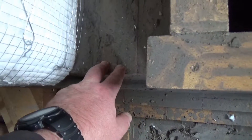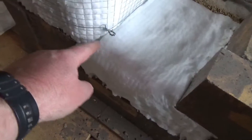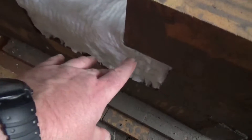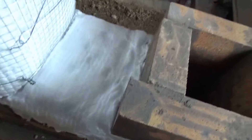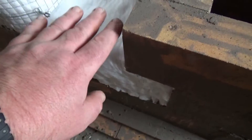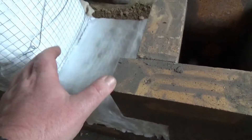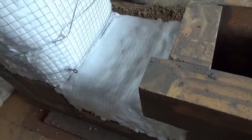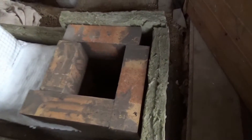That's the last bit of ceramic. I've cut it down to size and cut little notches out so it fits really nicely into the little recess from the way it was constructed. The little bits that got cut out have been used to tuck into the ends - it's worked really nicely, looks almost like it was made for it. The next step is rockwool to wrap the rest up to this height. I don't want to come any higher - when the manifold comes through I want a good thickness of material for the barrel to rest on, and I don't have to cut any brick. We'll just wrap everything in mesh and the insulation will be done.